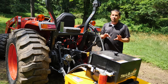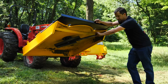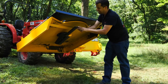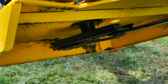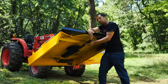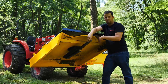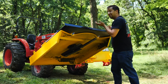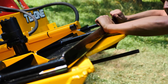This is a really nice add-on — it completes the piece quite well. The business end of this is going to look much like a traditional rotary cutter. We've got big blade bolts on the underside with some traditional rotary cutter blades. These are reversible — if you dull them out and hit some rocks, you can simply flip the blades so you have another cutting surface available. These blades can also stick out beyond the end of the mower. If you pull this thing the whole way out and look straight down, the tips of the blades actually extend beyond the mower, allowing you to go up to small trees and hack through them. This big safety shield up front is spring-loaded to keep things covered during normal operations, and as you push up against something it can go back so you're able to push a small tree into the gap where the blade can come around and cut it.